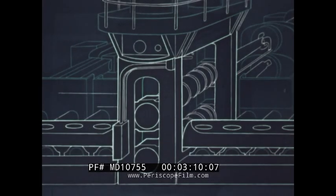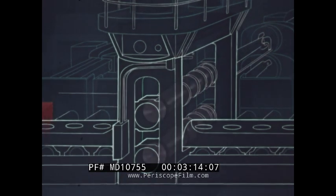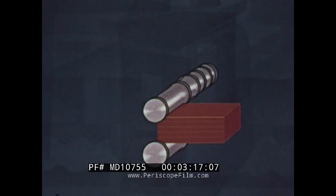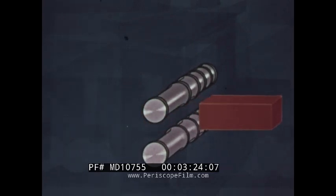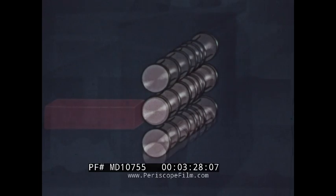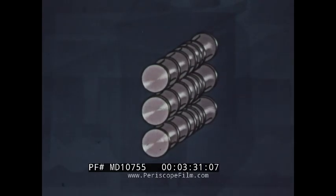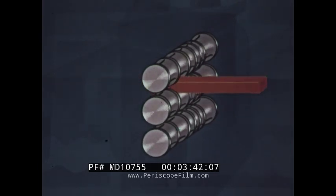Ingots may be rolled on mills of various types. Many ingots are rolled into shapes with squarish sections called blooms. On a two-high reversing mill, the hot steel is passed backward and forward between grooved rolls to form the bloom. In the three-high mill, the top and bottom rolls turn in the same direction, the middle roll in the opposite direction. The bloom is passed through the bottom pair from one side, then raised to the level of the upper pair and passed through these from the other side.